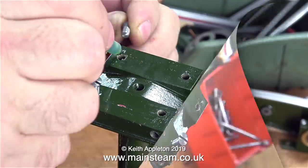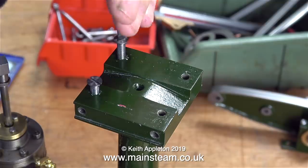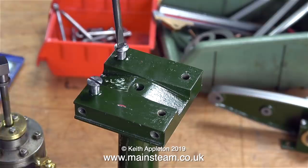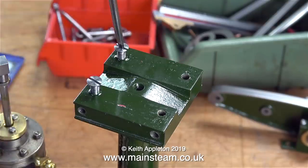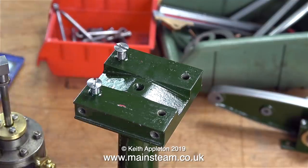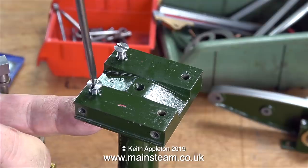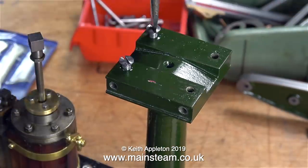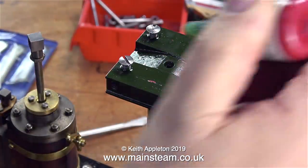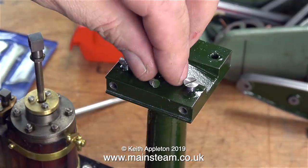You can fill metal by using other metal, and here's the principle. I'm using Loctite 603, which is a bearing retainer, which will very tightly retain these four countersunk bolts in the holes in the top of the column. As I was screwing these countersunk bolts into the holes, I noticed that a plug of filler was coming out of the bottom — so another mistake had been made. The builder drilled these holes all the way through the column, which wasn't really necessary. And here to prove the point is a plug of filler on top of the column.